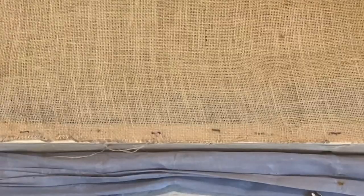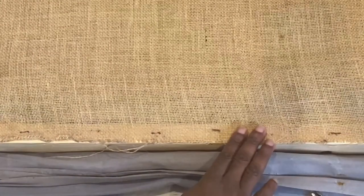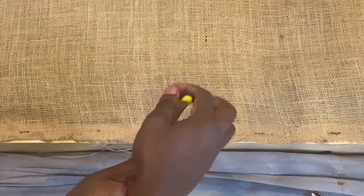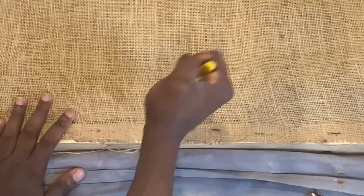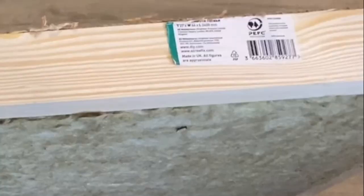Run the palm of your hands very gently over the pine wood to check for any protruding staples — don't press hard, just use your fingers. If you find any protruding staples, use a plier to take them out, as broken staple heads are not always easily visible. After taking off the front cloth, the rock wool is still sitting in place. To make sure it doesn't drop, get the acoustic speaker cloth and replace the obsolete front cover. From here, repeat and reproduce the process for all seven panels that still have the obsolete front covers on them.